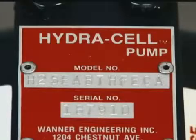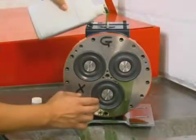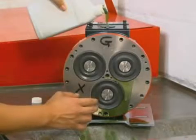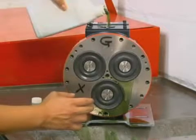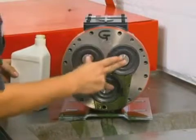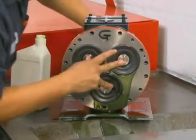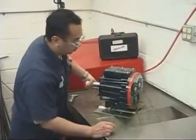Non-kel cell pumps do not have a K in the fifth position. With the pump horizontal, the fluid end head removed, and the diaphragms in place, fill the reservoir with the appropriate hydro oil for the application. Have a catch basin for oil that is pumped from behind the diaphragms when priming. Catch the oil and dispose of it properly — do not reuse the oil. All of the air in the oil within the hydraulic cell, behind the diaphragms, must be forced out by turning the shaft, and thus pumping the piston.